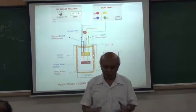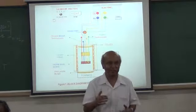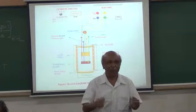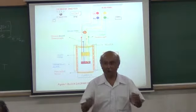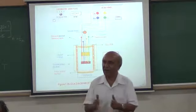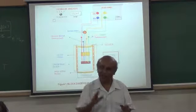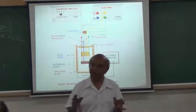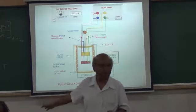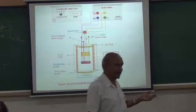Like we have the same instrumentation amplifier, with say 4 channels. It measures 4 channels, with A to D conversion. One channel we can always short and keep. So all the drift of this is stored, and then I can decide my actual measurement, so that even if it varies over time, I can correct for it in an advanced way. But normally with these instrumentation amplifiers, you can easily measure a microvolt level signal.